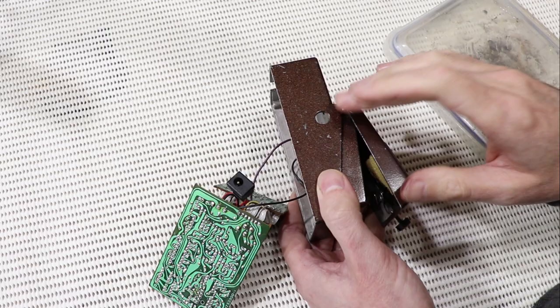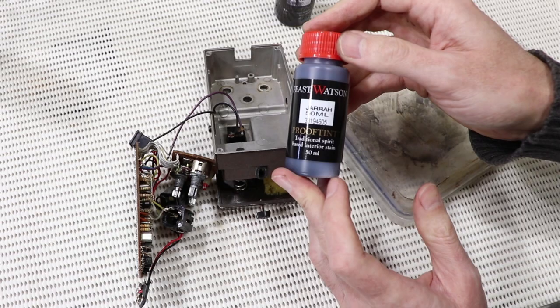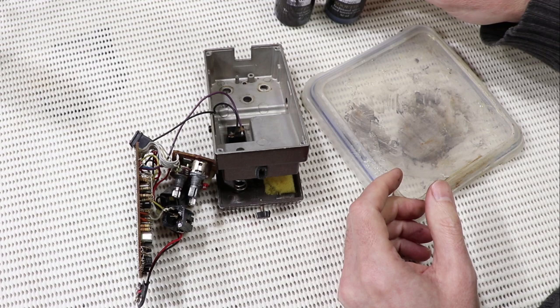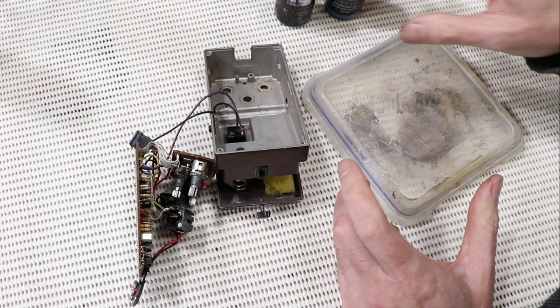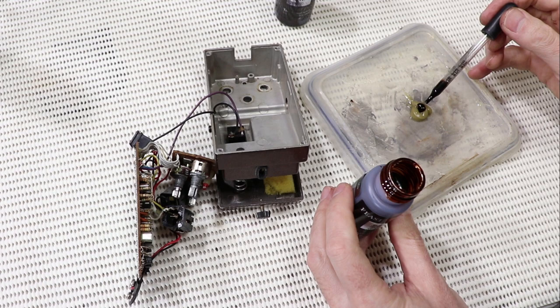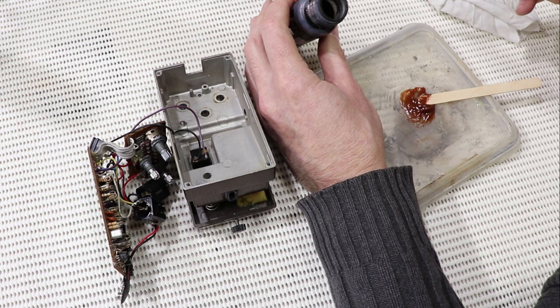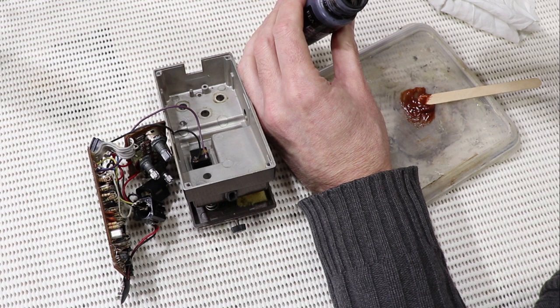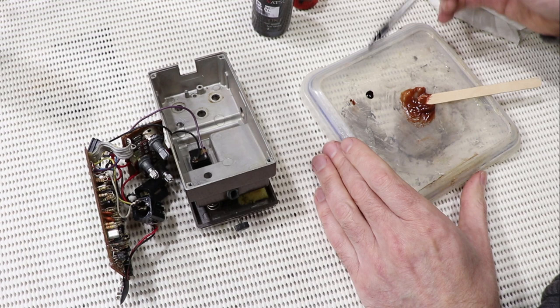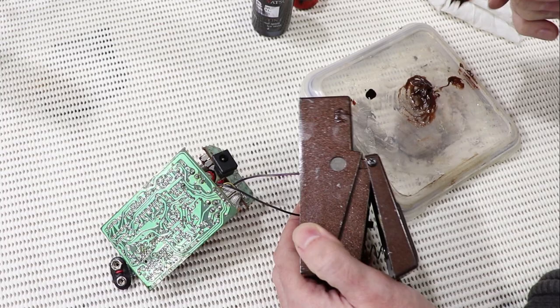So I'm going to try and tint the filler to get close to that color using these spirit stains, or dye stains as they're often called. Unlike an oil-based or water-based stain there's no binder — as far as I know it's just fine pigment and solvent. The solvent in a spirit stain is usually compatible with a polyester or fibreglass resin. I'll start with a drop of this Jarrah, which is an orangey brown color. It's getting there but a little bit light. This black one's almost empty so I'm not going to bother cleaning the eyedropper. I think a whole drop is going to be too much, so I'll put a drop off to the side — these stains are very strong. That's actually pretty close; yeah, I'll run with that.